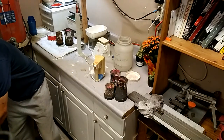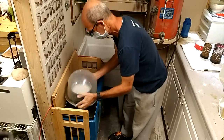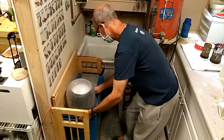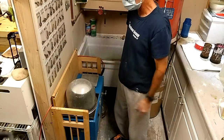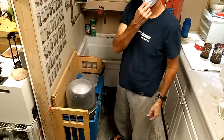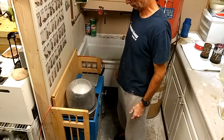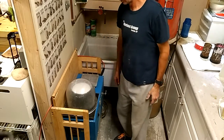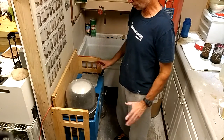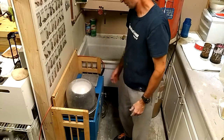I've got to move it over to the casting machine, which is actually going to be used just to draw the air out of the investment. It's slowly going to draw the air up and out. At this point I can take some off. I have about eleven minutes before this really hardens. It's risen up to the top — now I'm going to turn it off, releasing the air.